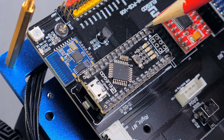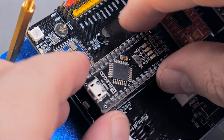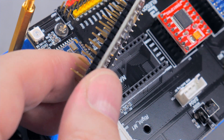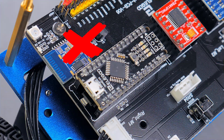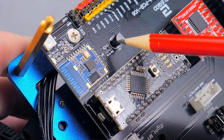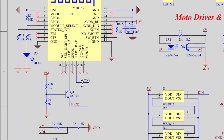This robot uses encoders to have feedback about the rotation on each motor. Even so, the robot I got was always curving a bit, pushing to the left. So I made a patchy fix for this problem in the code — I tried a few values and now it can go forward 100% straight. I discovered something really cool in this board: the Bluetooth module communicates to the microcontroller using the RX and TX pins. But here is the catch — in the Arduino board itself there is another chip, the USB to serial converter, that comes already connected to the RX and TX pins. This is a nuisance for many projects using Bluetooth modules: before you plug the USB to upload new code, you need to disconnect the Bluetooth module, upload, and then reconnect it. But not in this kit — Elegoo did something really clever using a transistor and two resistors, so the Bluetooth module can stay wired to RX and yet you can program the Arduino using USB.